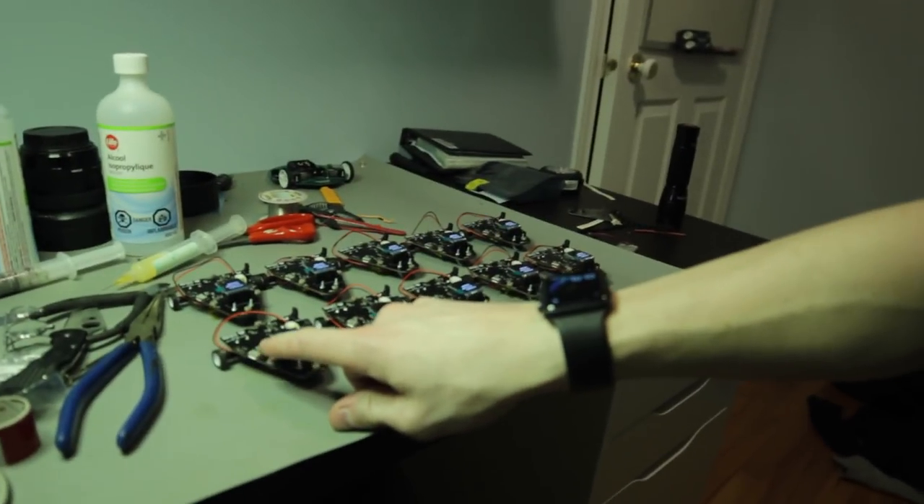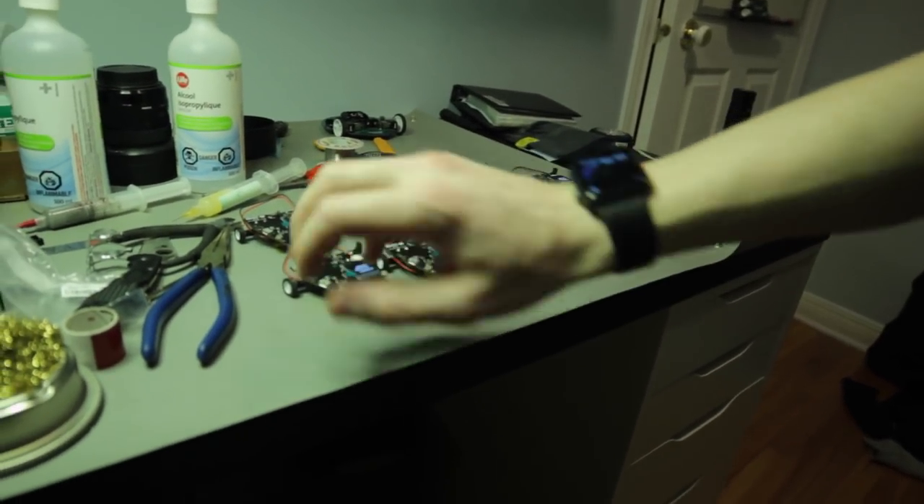So as you can see, some of them actually trained a bit weird — they were just spinning in circles. That can happen when the light is fully on; whatever the training decided to do, that was the outcome when fully lit from above, so it spins in circles. But once you give it a partial shadow it runs straight towards that shadow. Also, there's a little OLED tag screen protector that may have been blocking one side's photo resistor, causing them to skew to one side. It was cool seeing them scatter and move away from the flashlight. That's how it works with neural networks — you need to play with them and tune them, and you don't really know the outcome. They're all different; every single one behaves slightly different because of the randomness of the neural network and its initialization.